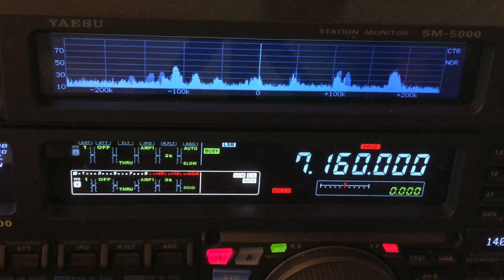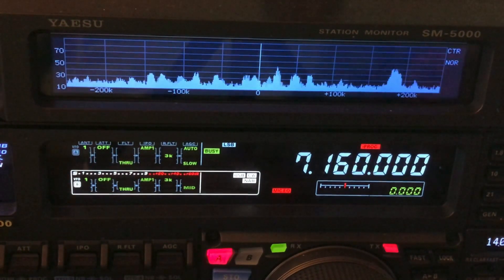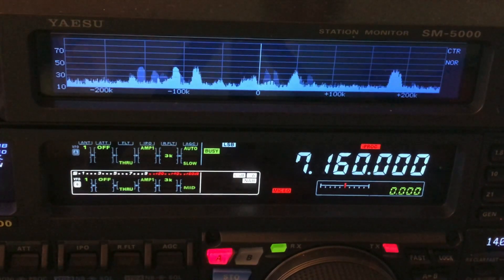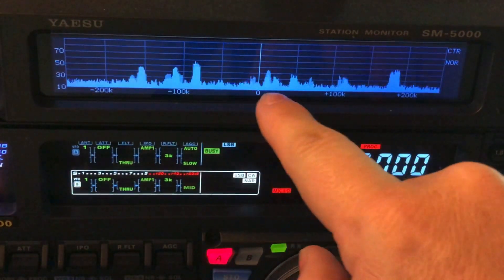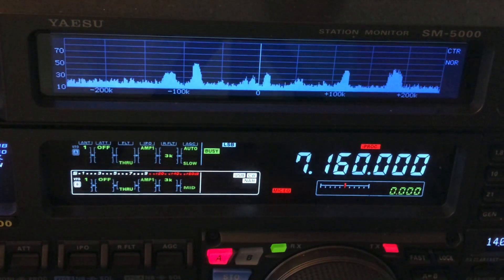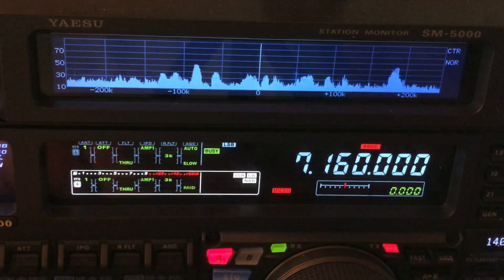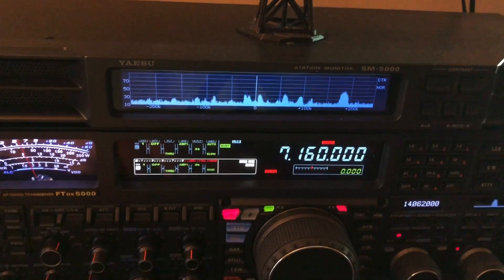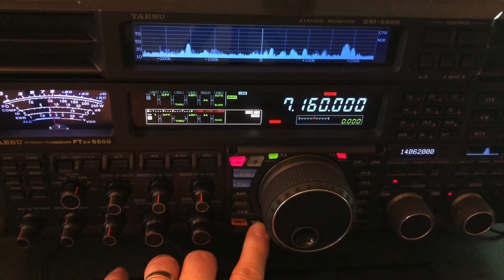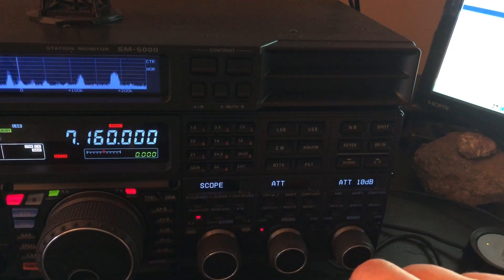Let me get into what the video is about. Chuck noted that in the video I shot a couple of days ago when I chased the Arizona SOTA station, it was a very very low signal — right at the noise floor — and Chuck noted he didn't see any blips on the display. When she talked we really didn't see anything moving. There are two reasons: one, she's at the noise floor, but let me show you something else. I'm going to long-press the CS button — if you have the SM-5000 hooked up, long-press the CS button to get into the menu.